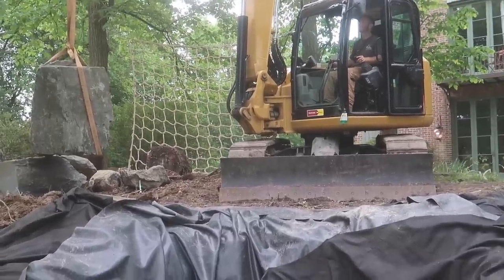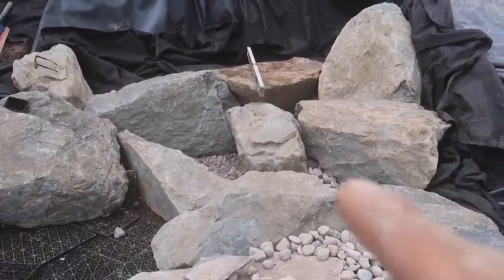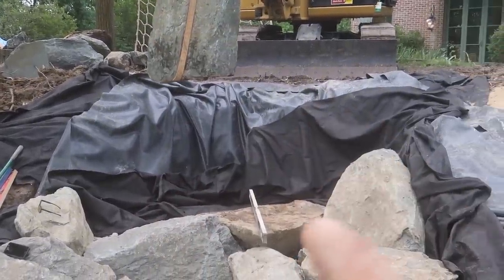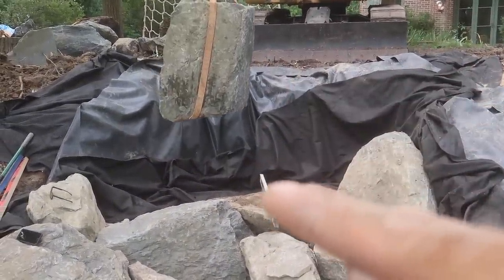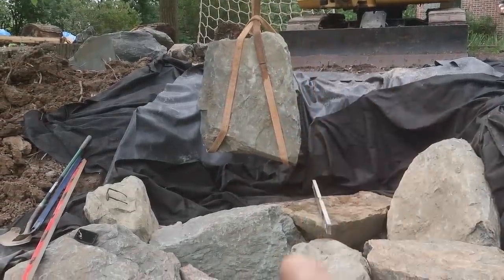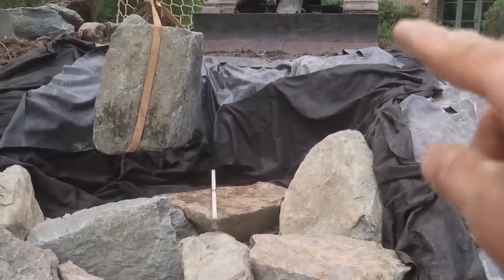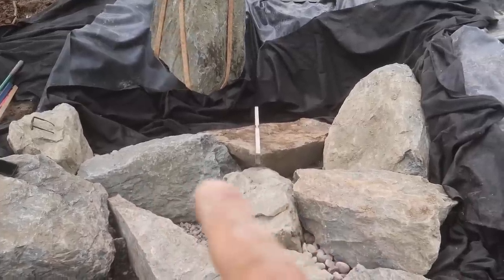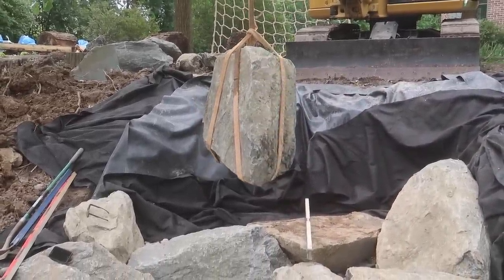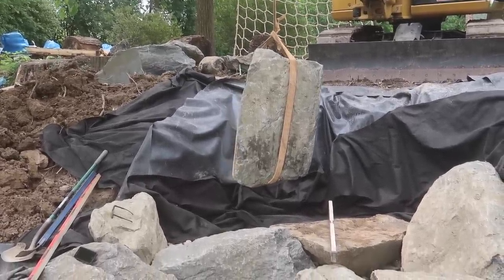Nick's in the machine, we got some good tunes going and we are rocking and rolling. We've got about six and a half to seven tons set already. We've got a confluence of waterfalls — this is where everything collects down in this basin. Lots of white water. Now we're going to really work on creating some tall drops through here. From that point to right about there is about a four-foot-plus grade change, so we're going to use this as one of the frame rocks, getting a big sheet-style waterfall facing this way, and maybe a ribbon or horsetail fall gravity-fed from the upper pool to add some visual interest.